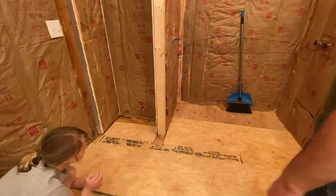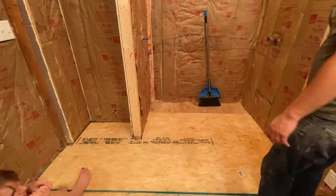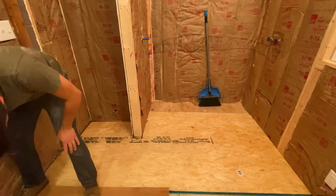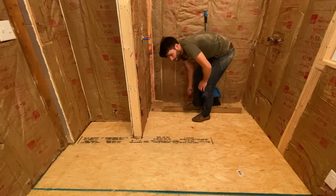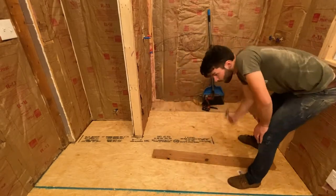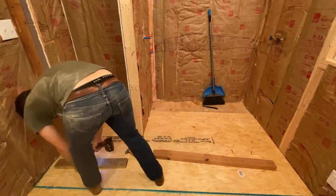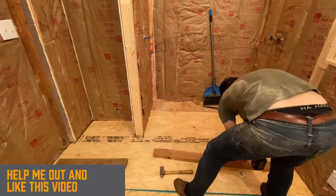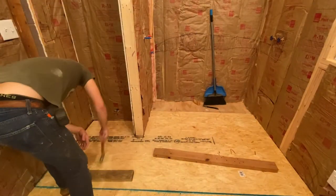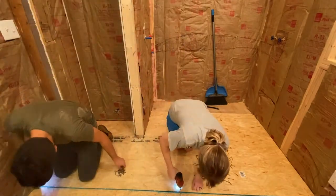Now it's a great time to have a piece of two-by-four or scrap wood to hammer on, because you do not want to damage the tongue and groove on the subfloor. If you do that, it's going to be really hard to get that joint to go together right, and you might end up with gaps in your subfloor that could cause issues when laying flooring on top. With these joints you want to hammer them together and make sure they go in tight so the floor is the strongest it possibly can be with no gaps. In a small room like this, I'm actually going to put several screws in a two-by-four just long enough to go into the subfloor — not into the plywood below — so I can hammer on those and pull it into place. Once you're done, just remove them and you won't even notice they were there.